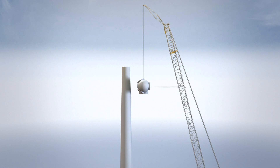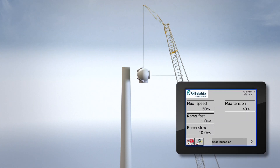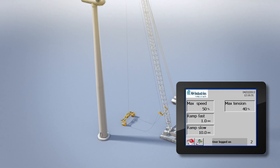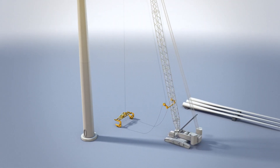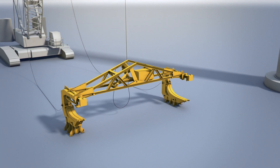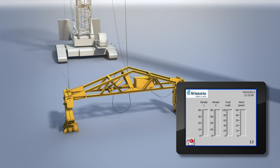Select the setting on the tagline master winch for the blade lift. All settings are preset in the program and are easy to select. When the crane hook and the taglines are connected to the sea yoke, set the tagline master winch on and you are ready to lift.